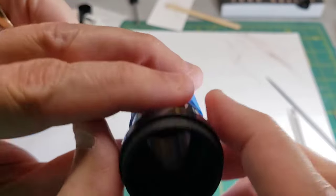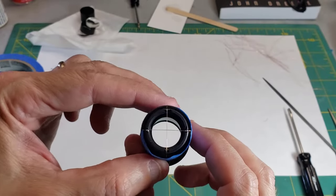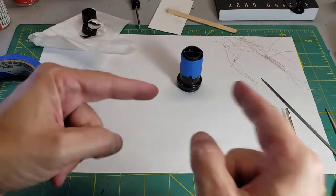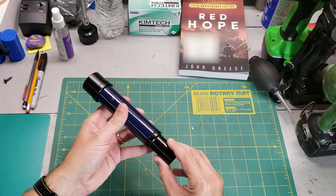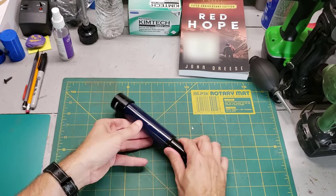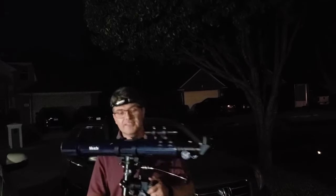Here are the new crosshairs, and here you can see where the epoxy was put on. I'm going to set this down and let the epoxy cure for a while, and then we'll put it back into the body of the viewfinder and we'll be all done. Once we've got the crosshair ring screwed back in, we just thread it back like this — and we're done. Here's what it looks like before and here's what it looks like after. You can tell the copper wire is a little bit thicker, but it still looks good. Thanks for watching — please like and subscribe. Clear skies everybody.